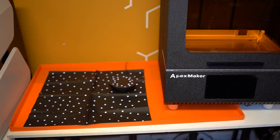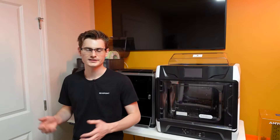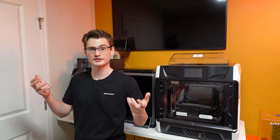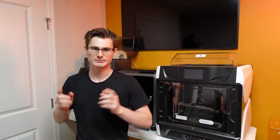Another important spec is the single frame capture detail. The Inspire can capture 240 by 130 millimeters in a single frame with up to 0.2 millimeters of accuracy. Seeing as there are other scanners that can capture between 0.02 and 0.05 millimeters, this is definitely going to be a limiting factor of the Inspire. The scan volume can be adjusted slightly within RevoScan 5, but the Inspire is designed for medium-sized objects — minimum scan size is 50mm cubed and maximum is 2,000mm cubed, though those should be your edge cases.